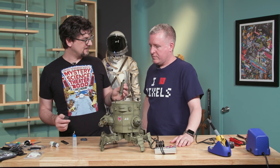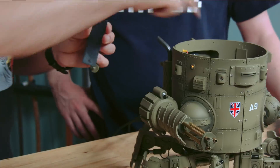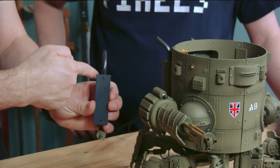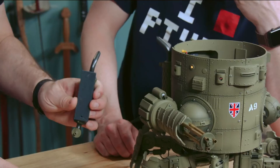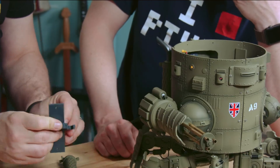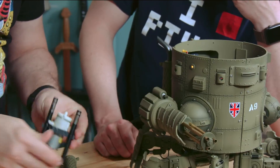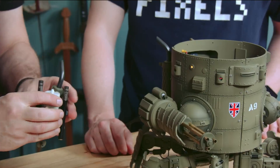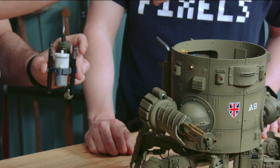We took off one of the smokestacks — it screws on from the inside. I made a 3D-printed inside plate, measured the diameter, and modeled a curve to match it. The back plate screws through into the muffler. I also made a bracket that glues onto that plate to hold our smoke pump and e-cigarettes, mounting on the interior wall right behind the smokestack. The hoses use one Y-connector joining the e-cigarettes into the pump, and another Y going out to the two smokestacks.